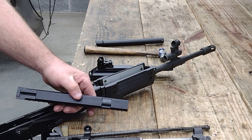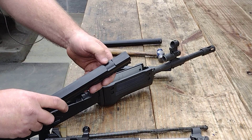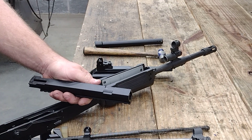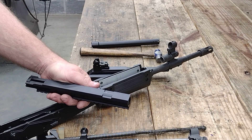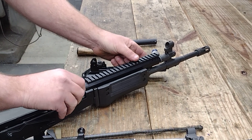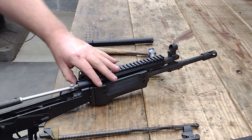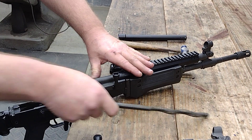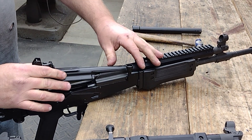The clearance cut for the retainer on the front works great on ARs and ARMs; this one works great on SARs. If you have a South African handguard, which puts the retainer further forward, you're going to have problems — you'd need the cut way up here, and doing that is on you. I currently have no plans to do them for South African parts, but that could change. If you've got a factory gun it should go right on out of the box; if you've got a kit gun, you may or may not have fitment issues.